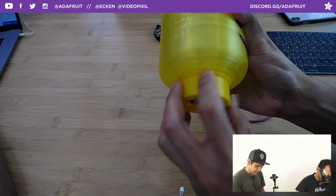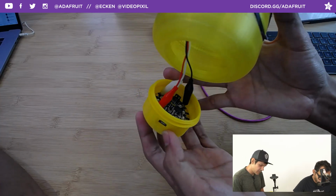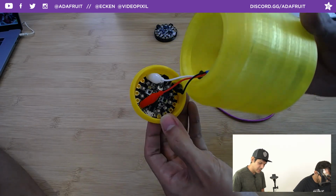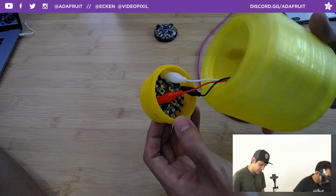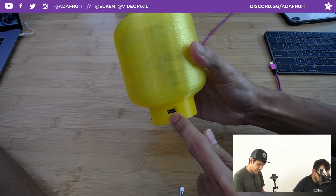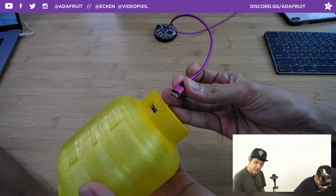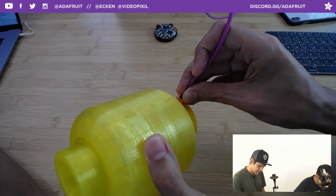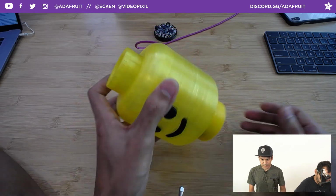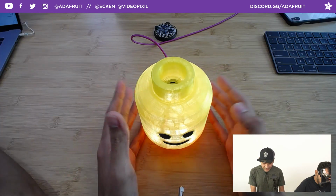So that's where the Circuit Playground is. It snap fits into this little case. There's a CPX in there. You want to be careful which pins you pick. Some of the standoffs cover up some of the pins, so you want to make sure you're using the 3.3 pin, the ground, and A0, which is the PWM pin. So that threads in like that. And the micro USB port is right there, accessible, so you can plug it in. It's meant to be a USB powered project, so I got my little fully reversible micro USB cable. I'm going to plug it in here and get your little status LED. And so there we go, it's on. So if you shake it, it should play some audio. Awesome! Very nice. And what's cool about this is that the head is doing two things.